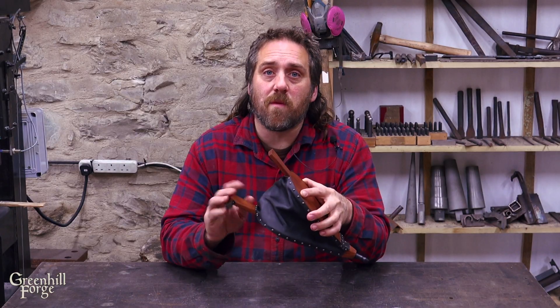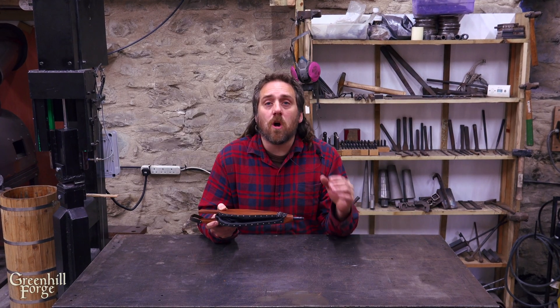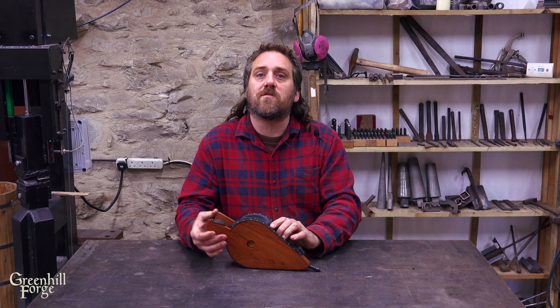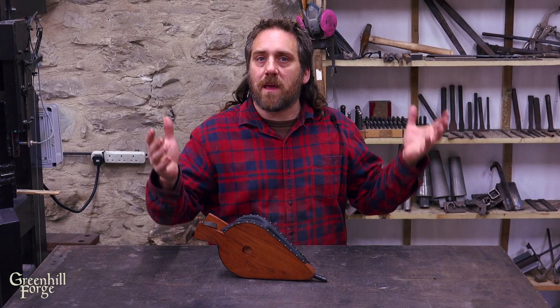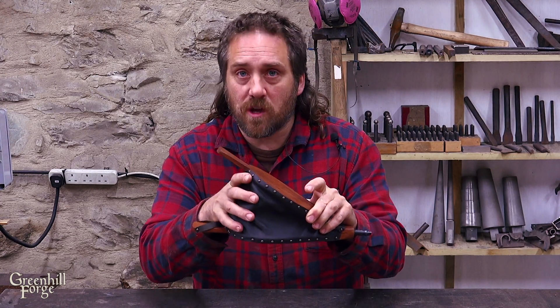So what's actually happening with the example of the bellows is that as it's squeezed, the air is accelerated out of the nozzle — and this is where the principle takes effect. The air coming out of the bellows is moving quite quickly, which also means that it's low pressure. So it's creating an area of low pressure that's shooting forward, and what that does is force the surrounding atmosphere to rush in to fill that area of low pressure, to equalize it and bring it back up to the same pressure as the surrounding air. So for every squeeze of the bellows, you're delivering far more air than the volume just trapped inside.